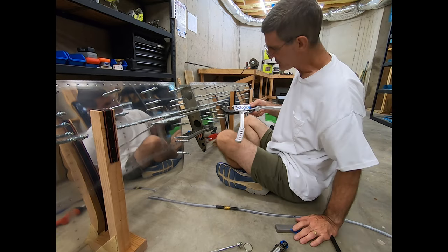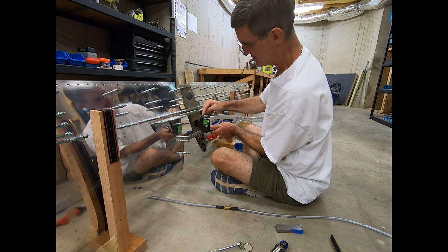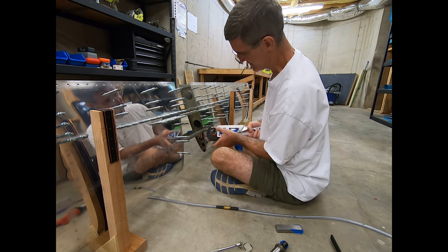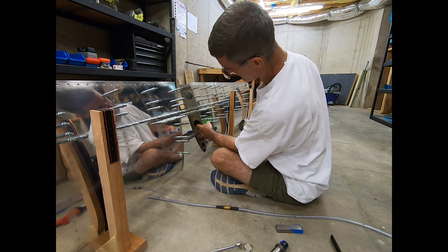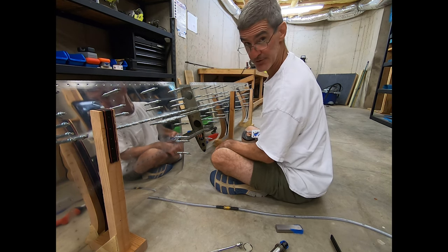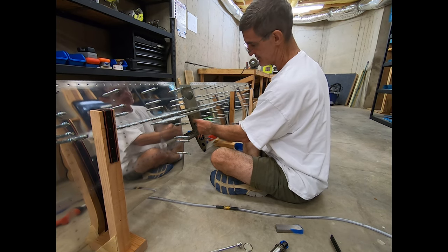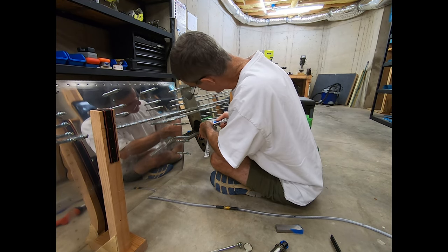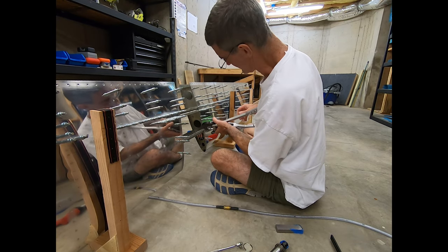This one's a little tricky — I get worried that the squeezer, this lip of the yoke can catch inside this lightning hole if you're not careful. And if that was the pneumatic and it was caught and you hit the button, it's going to bend this rib before you know what happened. Whereas with the hand squeezer, I can carefully watch and make sure nothing like that's going on.